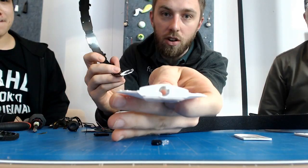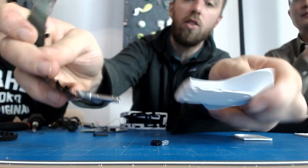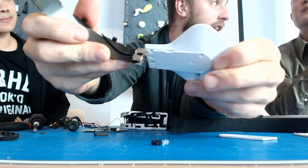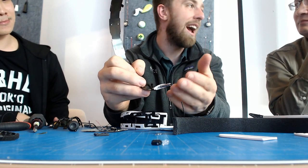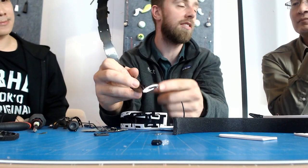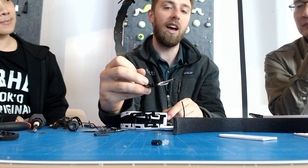We can see the feature that's right on the inside there, which has a groove. Can we see that okay, guys? And so the same thing, there's a feature on this. So when the shaft fits in, you're actually able to rotate and it stops. You can't turn it any further. And so the metal injection molding is great. We do this for gears all the time. You wouldn't get this with a die cast method, or if you had to machine these, it'd be way too expensive. It's actually very similar to metal 3D printing. We do a powder, we bake it afterwards and bake off a resin. So it's a really interesting process if no one's ever seen it.